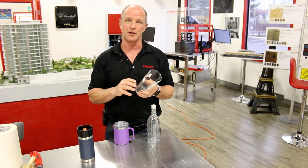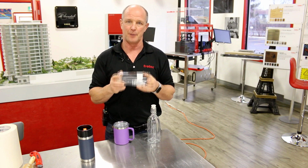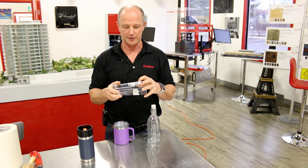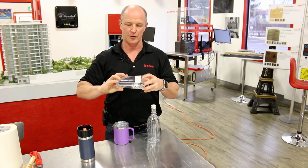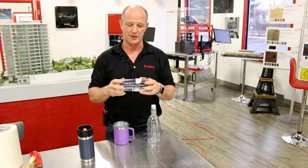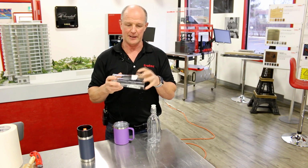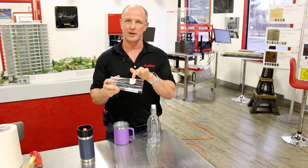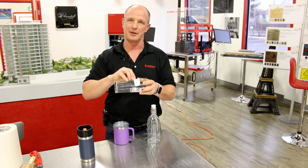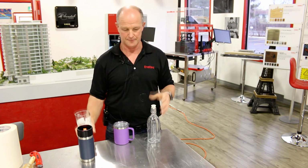So normally what I'll do is I'll line up 50 glasses, and I'll have tape on each one of these. Now, I could come across here and line up with this and have it turn all the way back here. I can do that too. I just tend to like to do it this way because I like to have the red dot pointer exactly where I want to start. And again, when I put this in, the red dot pointer is right on the plus symbol here. Then all I have to do is peel this off and press the go button, and off I go.